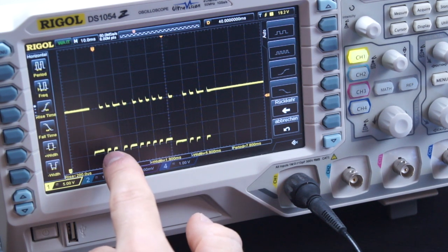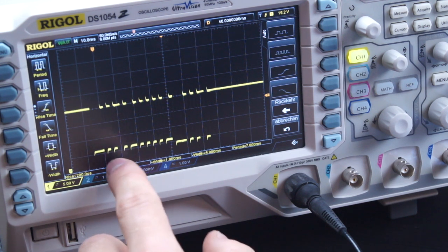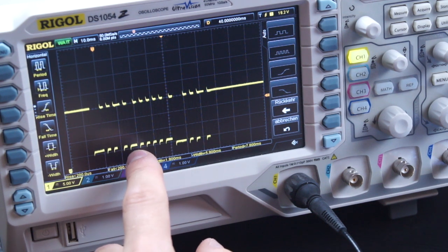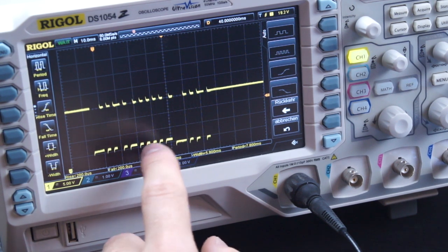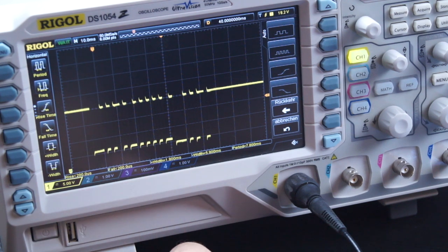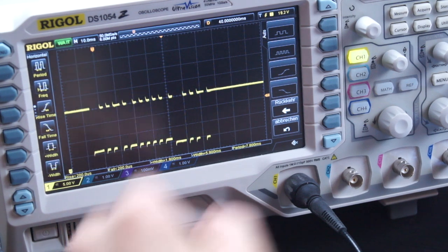The message itself: the first bit isn't used, but after that we get 0001, which is a 1 in hexadecimal. After it we have 0010, which is a 2, and then we have 8 zeros, which is just 00. So we have the bytes in hexadecimal 1200, and this is just the light protocol. You can decode any protocol like this.